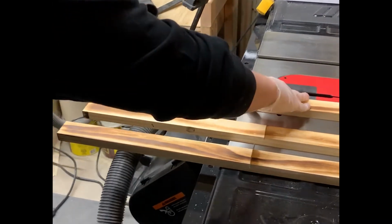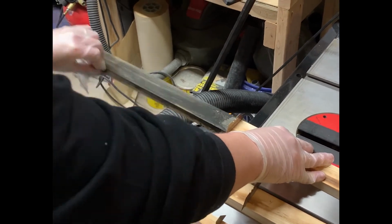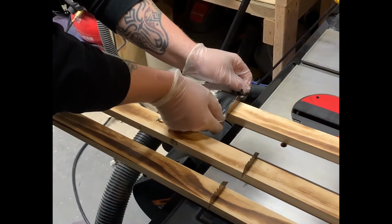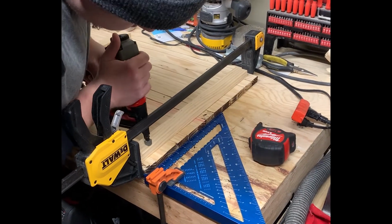So as we're looking at here, you tap in 3 razor blades, just enough to pierce the top grain, and you're going to stain up to the razor. It is going to make a crisp line and finish the union so everything looks nice and square. So give that a minute, let it dry up, and then pull the razor blades out, and that should be set to go. So pretty much here, you're going to flip and mirror the entire flag over.